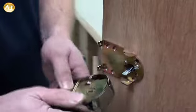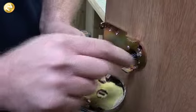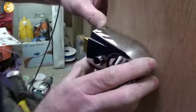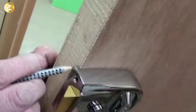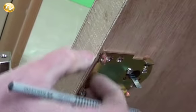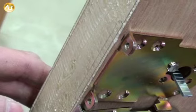The next job is to get our lock — it's got a slit in the metal that locates onto our bar coming through. Push that on and then I can see exactly where I need to rebate the lock. Draw around the lock with a pencil, take it off, and that's the section to rebate out. Once rebated, that will send the lock back onto the plate and then we can put our fixing screws through.